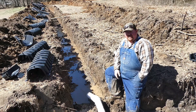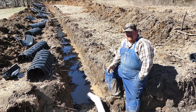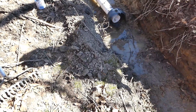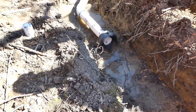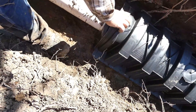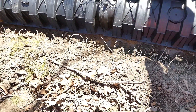We're going to run it down this crooked ditch I dug, and once we get all that done, you just cover it back up. You don't need the corrugated pipe with the holes, you don't need the gravel. Your ditch has to be flat, and we got all our ditches raked and ready for the Infiltrator install. There's the inlet cap with a flapper on the bottom — the water's not going to gush out, it'll fall pretty quick. That little flapper will catch it and prevent erosion underneath the pipe. The first joint of this Infiltrator will go right here.